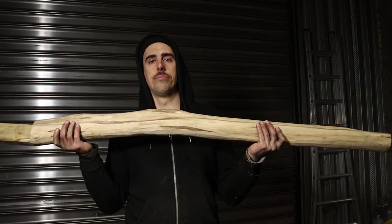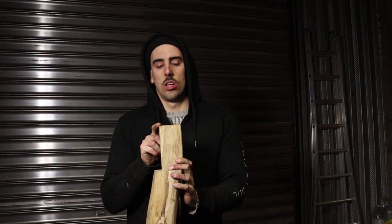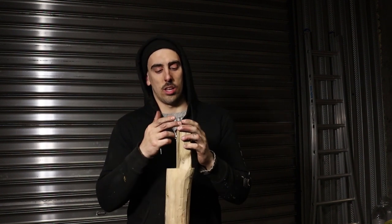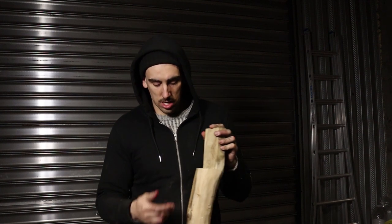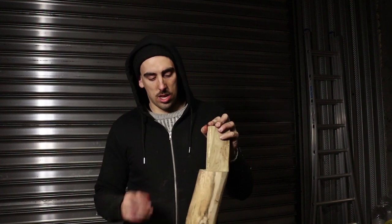To recap the technique as I understand it now, you have your crooked timber and you choose an orientation that you want to use it in. So maybe you choose the flattest side that you're going to use to build on. Then what you need to do is make a first snap line, then turn it to the side and level it. When it's level, you can use a spirit level to make the line also on the end grain. And next, you can make a square line to this level line on the end grain to draw a line towards the top and the bottom. After which, you can make your second snap line. So now you will have a cross on either end of the end grain and two snap lines.